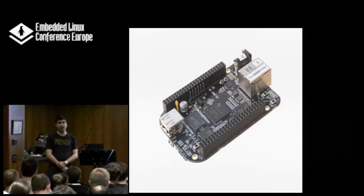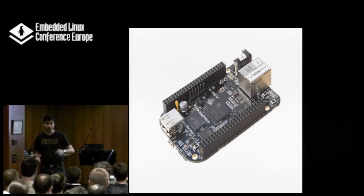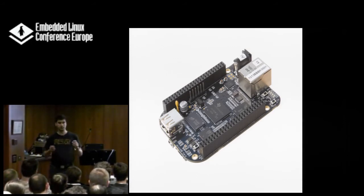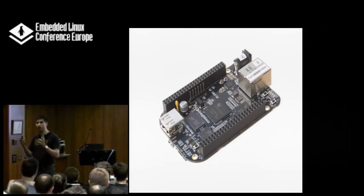Also, make your hardware guy — if you have a say in the development — stay close to the evaluation board. It really helps to have the evaluation board to go back to and try your software, to figure out whether what you're seeing is the software not working correctly or the hardware having a small flaw somewhere that is hard to debug. Get a couple of evaluation boards to modify. Your system will always have modifications different from the evaluation board, but an evaluation board is meant to be messed with — solder things out, solder new things in, get it working the way your product should.